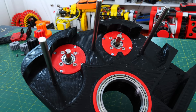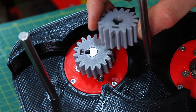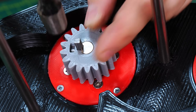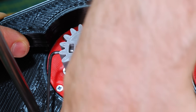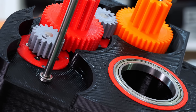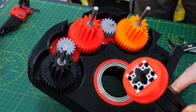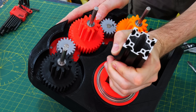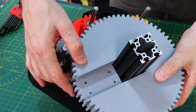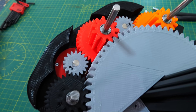The motors are mounted right through the gearbox and there's a 3D-printed plate on the front to mount them to. I put the gears on — these have a little grub screw and a captive nut, and there's a hole cut out to put a key in so it matches the keyway of the motor shaft, then we tighten up the grub screw. I'm using a couple of washers under each gear as a spacer, then we put those three colour-coded intermediate gears on. The main output shaft is a piece of 40×40 extrusion in a round hole, with a shim that fits the square profile in the bearing, and hopefully all those teeth should align perfectly.